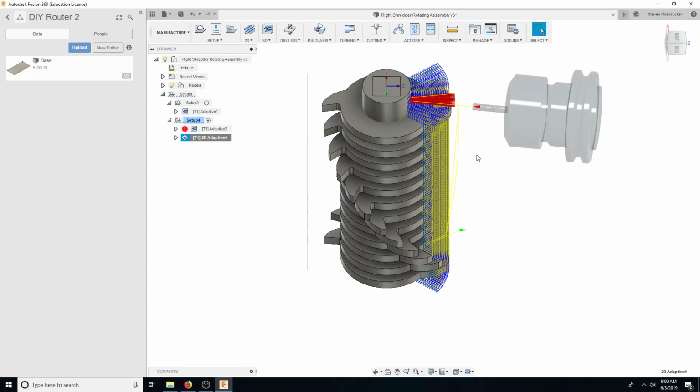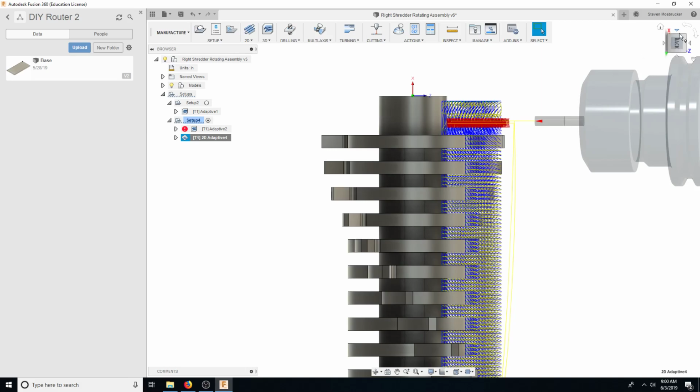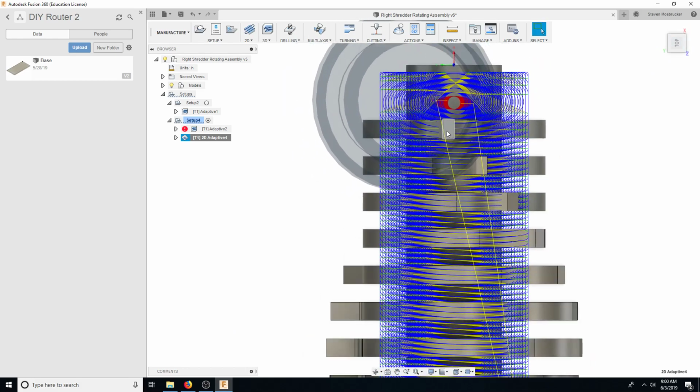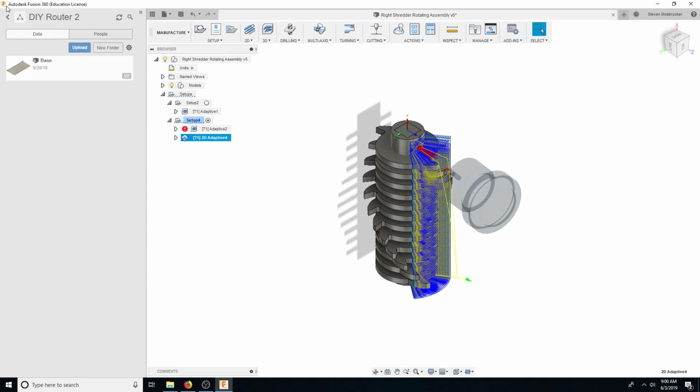So compared to a water jet, yes, it is longer, but it'll already come square and sharp, and it'll already be assembled. So I just pull it off. I put the 2 rotating assemblies together. I push the bearings into the little pillow block things, into the pillow blocks with the supports. I push them in there, and then I weld it shut, basically. So that's pretty much all I have to do to get this guy to be well on its way to working correctly.